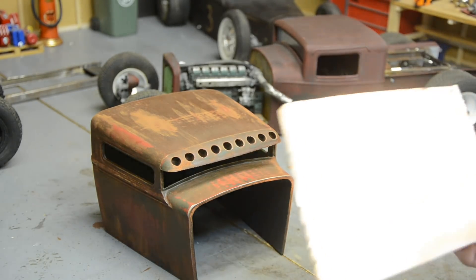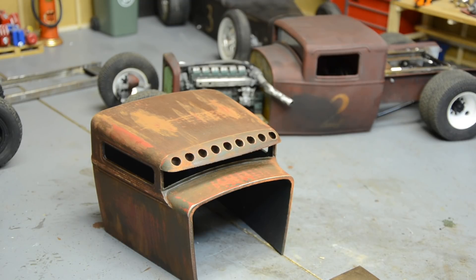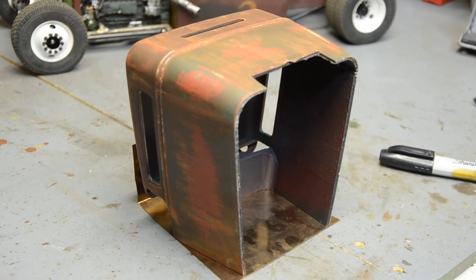I've got this piece of copper-colored sheet metal — it's kind of thin. I'm thinking about using that. I typically use 16-gauge steel and grind off the zinc finish so it starts rusting, then put it in the sink with some vinegar and peroxide to give it a cool look. But I thought I'd try this with copper. Once we reinforce the edges, this piece I had cut and folded for something that didn't happen, so I'm trying to save some material.